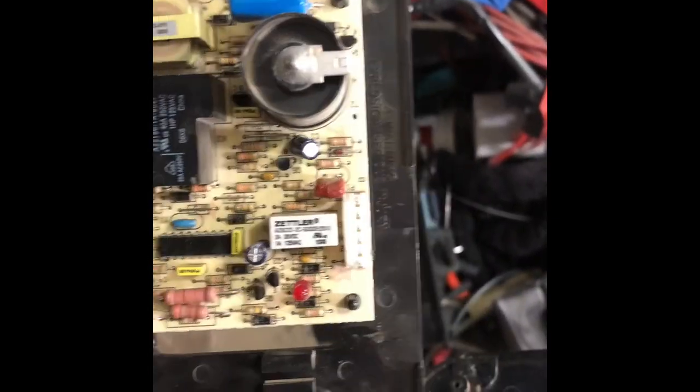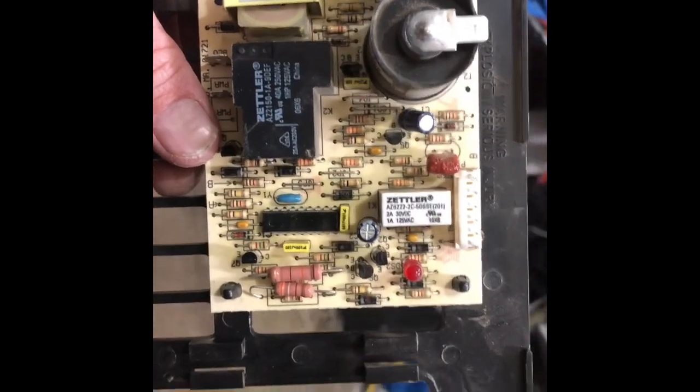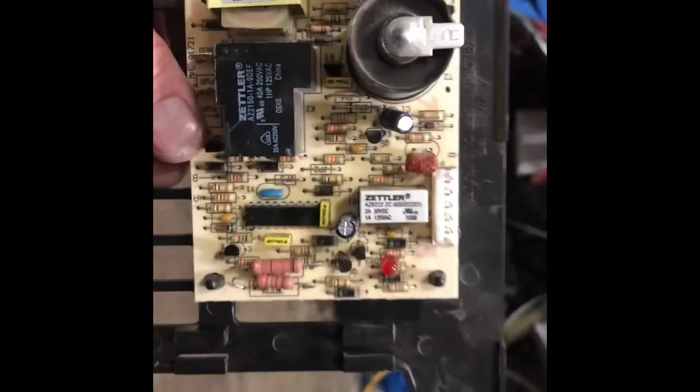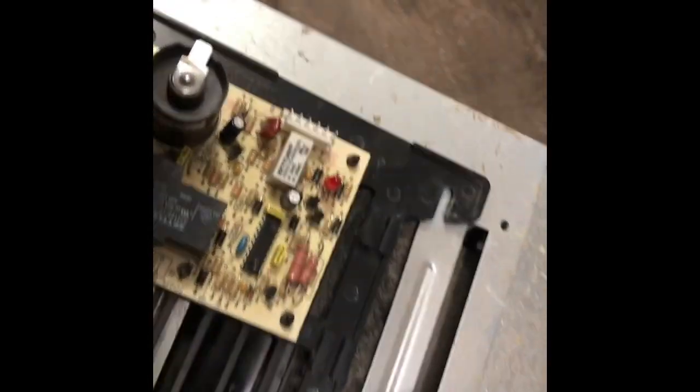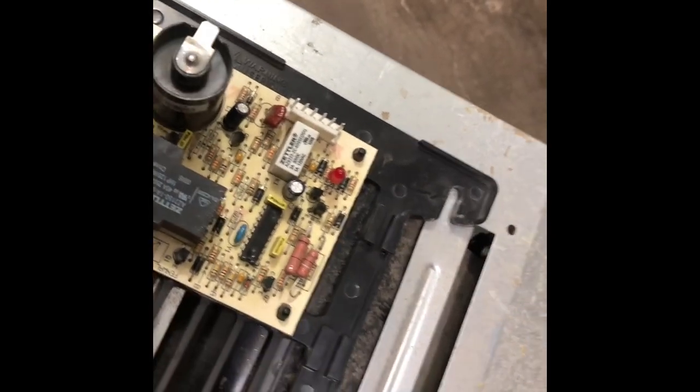If you were using a Fan 50 Plus, a Dinosaur board Fan 50 Plus, on this particular unit, you can get away with it. What I do is cut these plastic tabs off flush, because a Fan 50 Plus has its own metal standoffs on the board, which stand off.